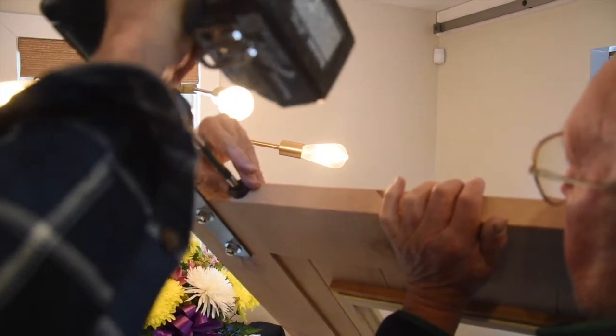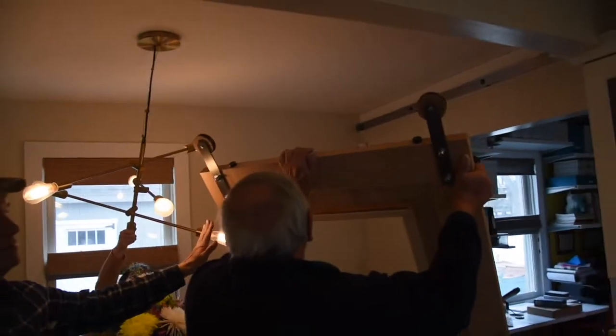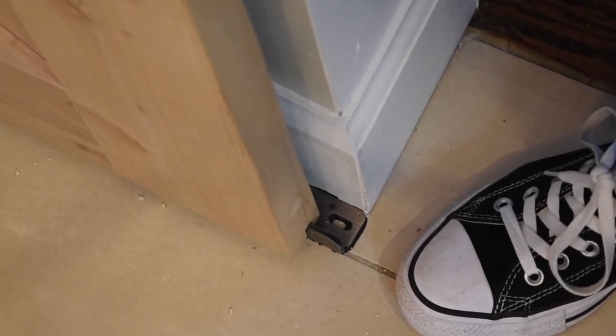Next, add anti-jump stops evenly on top of the door to prevent the door from jumping off the track. Also, use a door guide on your floor or wall. Rather than secure with a screw into our porcelain tile, we decided to use epoxy to adhesive the guide to the floor, again helping to keep the door on track. If using a mounting board, you may consider adding molding around the doorway to reduce the gap between the door and wall when closed. We decided against it for a cleaner look though.